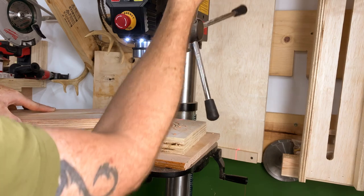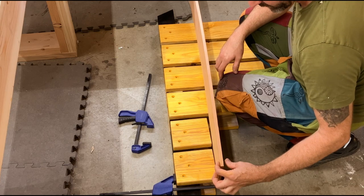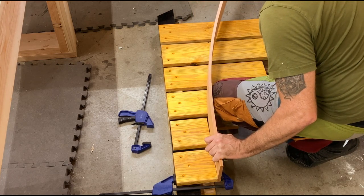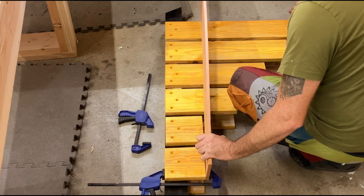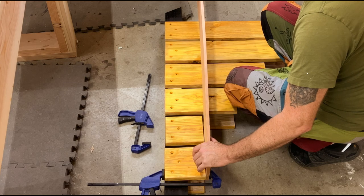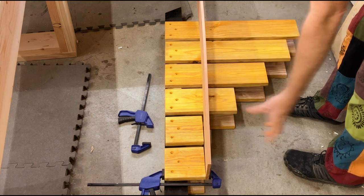Here's the issue: the cedar piece isn't bending enough. It was about twice as thick, so I ran it through the planer to thin it, but I can only bend it so far before it starts to crack — and we need a much tighter curve. We have to thin it down even more, then use more hot water. Once we can bend it all the way, we can trace it, cut it, and install that bent piece.